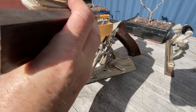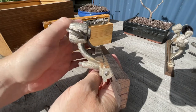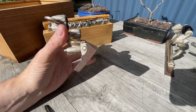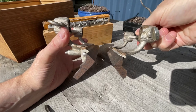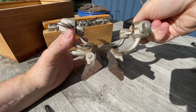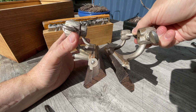In this position it is 90 degrees to the face of the timber, which is the same as your 45 and all the others. But it has the ability to pivot around to the 45-degree angle. That ability is on both fences — you've got a fence for both sides — which means the plane can now sit on the corner of your timber and act like a 72, taking a chamfer down the side. And not only can it take a chamfer, like the 72 it can also take a bead on the 45-degree angle down the corner of your timber.